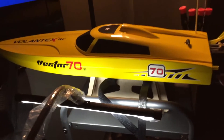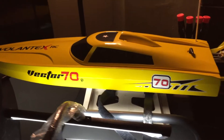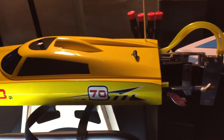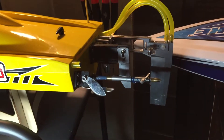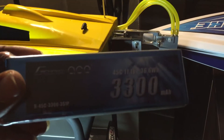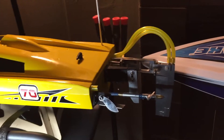Alright, it's a quick racing video showing you one of my projects. I previously showed you this boat in my earlier videos. I upgraded a couple things — the wider rudder helps me in the turns. I'm running on 6s with two of these Gens Ace 45c batteries. I should have just got 50c, but I keep it light going with less milliamps.